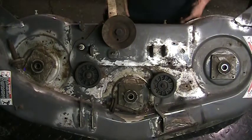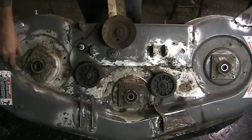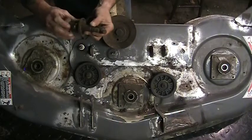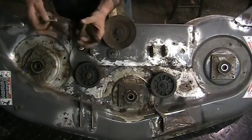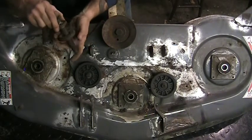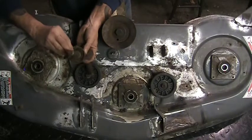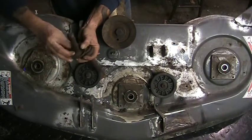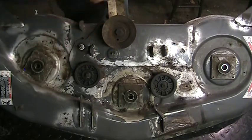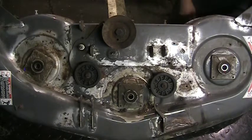This is just a little steel rod. That one's out, that one's out. No bearing — it stayed in the spindle on that one. Get these out of the way because I'm going to clean these up, get the rust off, and put anti-seize on them before I put it all back together so the next time they come apart it'll be easy. If there's any rope or twine stuck around these things, always get them off and clean them up. You want to make sure everything sits flat. This shield is supposed to guard the seal from dirt and debris — dig all that crap out of there. Jack shafts are in good shape.